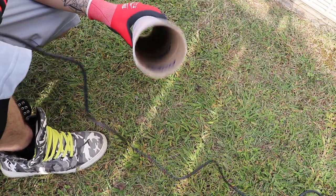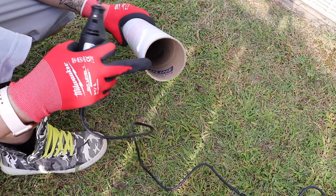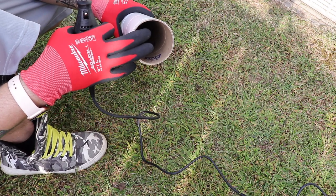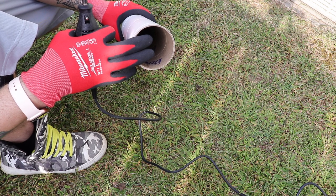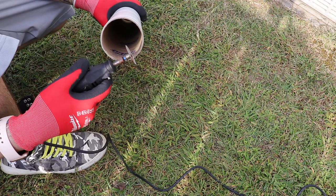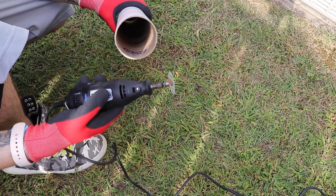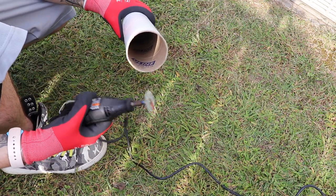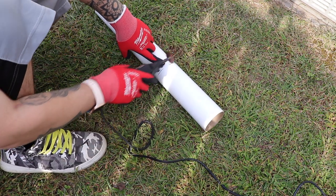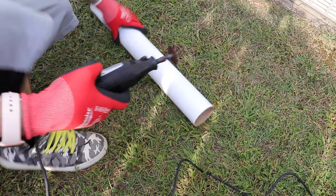This cardboard tube is pretty thick — it needs to be, because the heat gun is going to go in here. You can pick these up at any of your local shipping places: UPS store, mail and more, parcel place, stuff like that. I think this was $3.99. You want to try to get a diameter that's around four to five inches, maybe 10 to 14 centimeters. Once you measure out your eight to nine inches on here, make sure you mark it, put your gloves and safety glasses on, and let's get this cut.